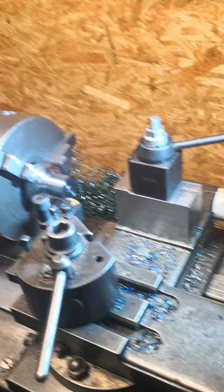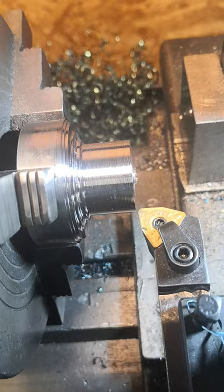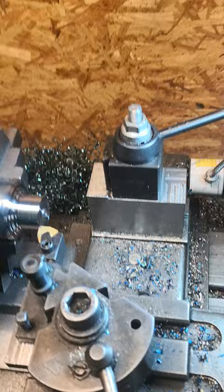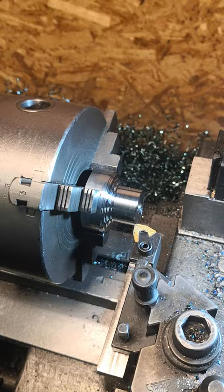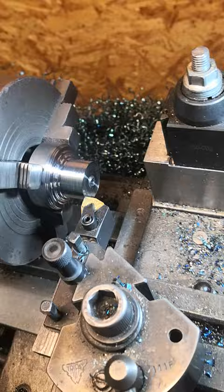I feed on the machine about 0.4mm with this high-tech cutting insert. This is a Toolox 44 — it is a pre-hardened tool steel, it is tough. Really a tough material. The inserts get used up; normally I use C45 and the inserts last for two months or longer, but with this steel they get chewed up.